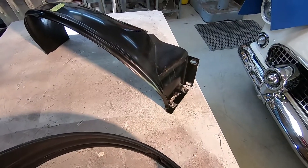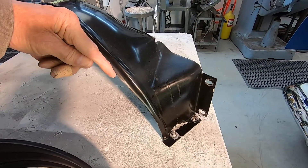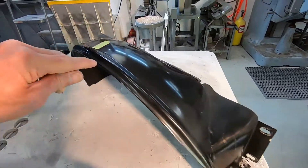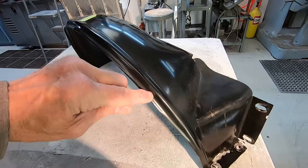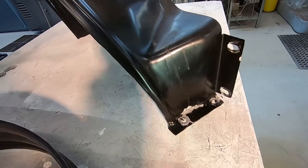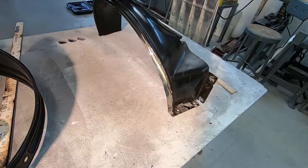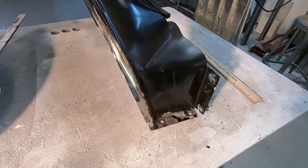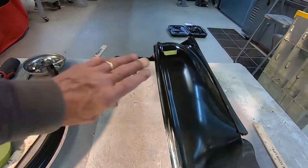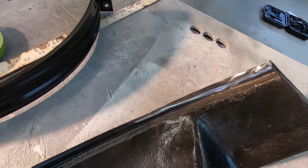The first thing I'm going to do is a little repair work on this shroud before I try to shorten it. If you look from here down to here, you can see this flange kind of tapers off — I guess there wasn't quite enough material at the factory when they were making it. So I'm going to weld a little piece in there to correct that. Here it is when I'm done — you can see it's a fairly straight line now, which should be pretty good.